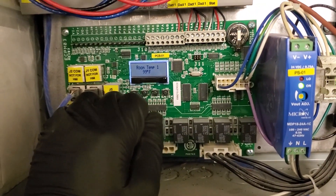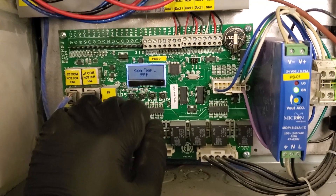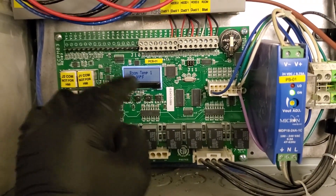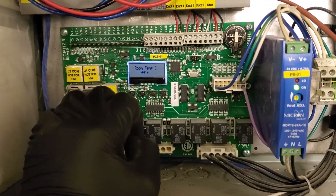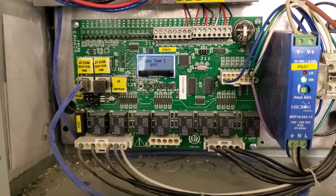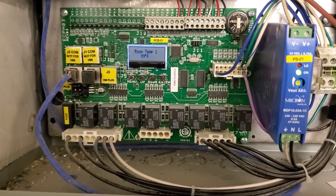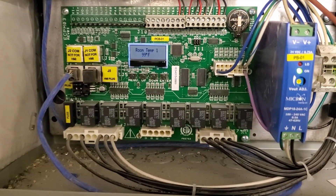Possibly when they had a power outage, my theory is that when the power turned back on, the hoods went into auto mode. If I unplug this guy right here, the hoods will power down, and then when I plug it in, they will automatically turn on without me hitting the hood switch, because they have a safety feature where it looks at the temperature and fires the hood up. When it's in auto mode, my understanding is that it uses a temperature differential to turn the hoods off. As those two numbers — the room temperature and the hood temperature — get closer together, it could theoretically turn the hood off, but then turn itself back on because it senses high temperature from the fryers that are still running.